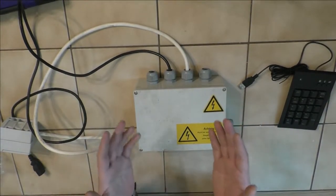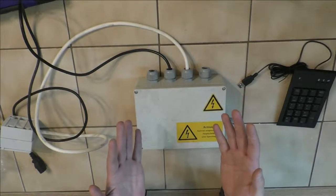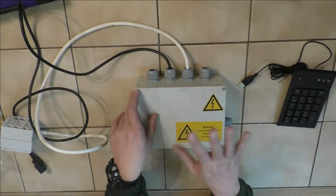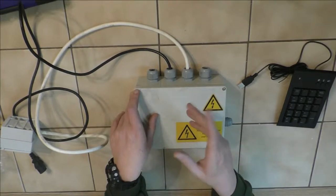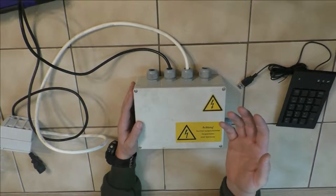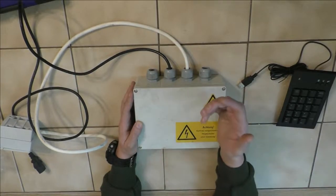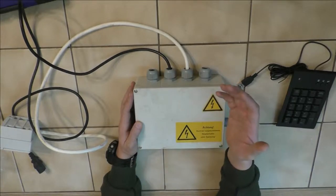As for electronics, basically I had two options. I could use a Raspberry Pi. I have quite a few laying around, which is good for the network side of things, but as I already know, Raspberry Pi is very dodgy when it comes to timing, so we might have an SPI problem or whatever. For that I want to use an Arduino, but of course the Arduino is complete shit when it comes to network. Yes, you can buy a network module, but you can't do encryption, and doing network without encryption even in a local network is just stupid, and everyone who does it should get a lifetime ban on internet.